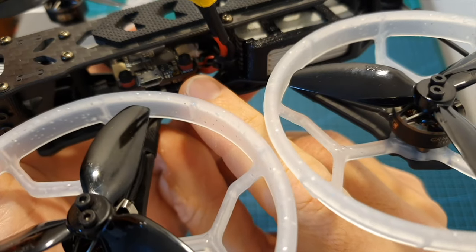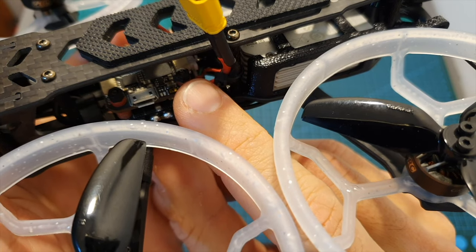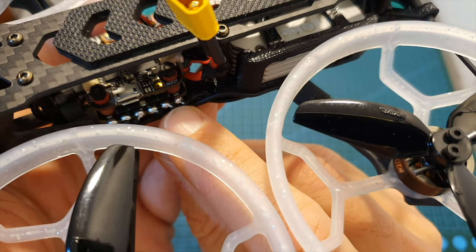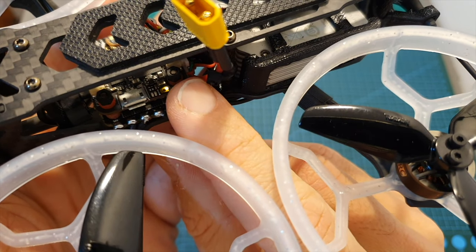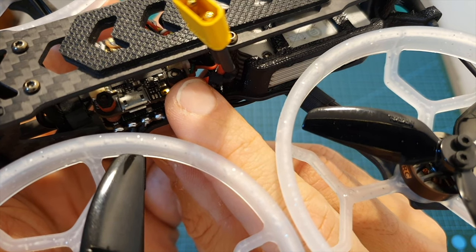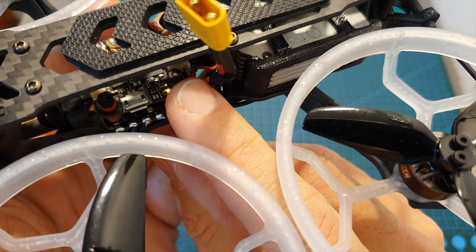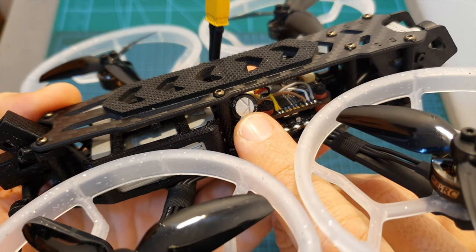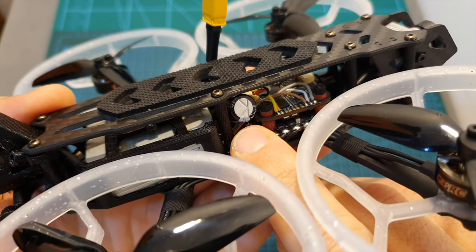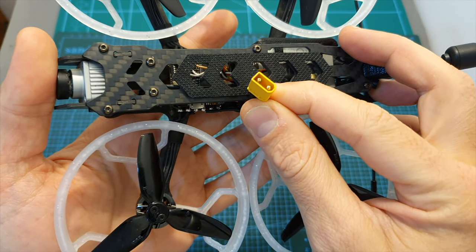On the front of the quadcopter, you can find the Geprc Stable F7 Pro 20x20 mini stack, which I've previously reviewed. It's based on a 35A 4-in-1 BLHeli_32 ESC and an F7 flight controller, which came pre-flashed with Betaflight 4.1.1, and features dual ICM20689 gyro chips. A 35V 220μF capacitor is pre-soldered to the battery pads. The battery is designed to be mounted on the top of the frame, and the quadcopter is using an XT30 battery connector.